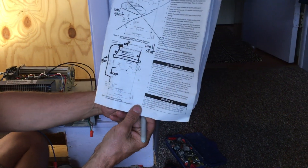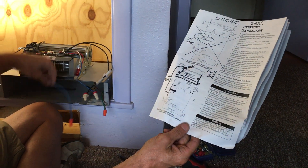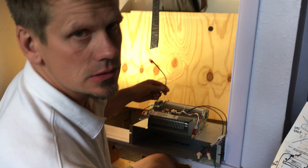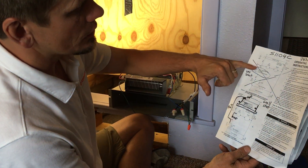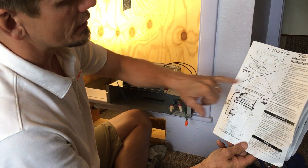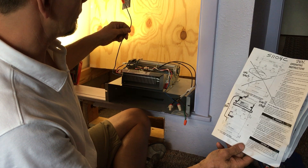This is a very unusual heater. In all my 21 years of wiring, you never cap a wire and leave it like this — this is very bizarre. But in the instructions, because you're not running blue to blue with a unistat, you have to cap it. If you don't cap it, you will blow it up.